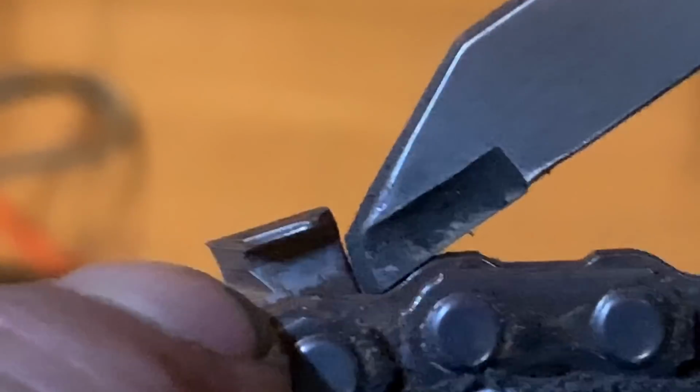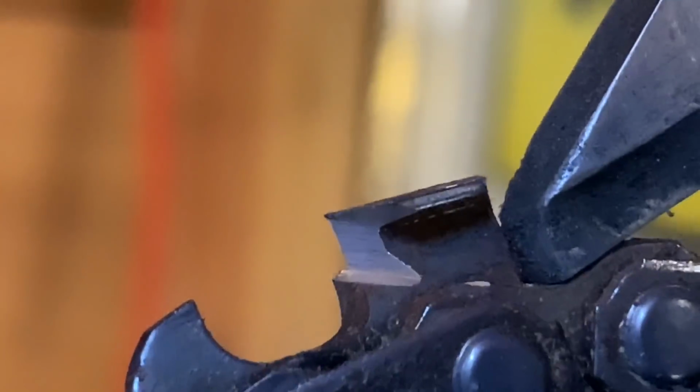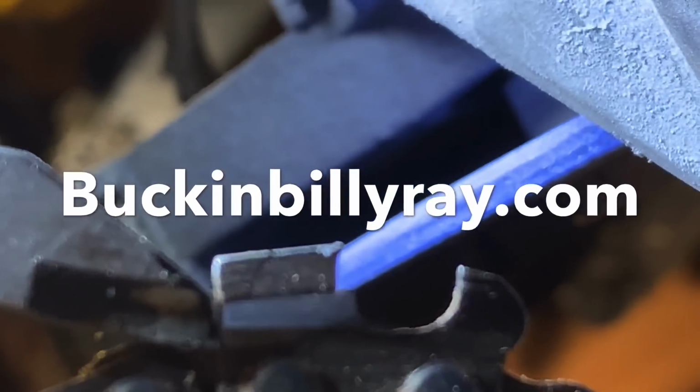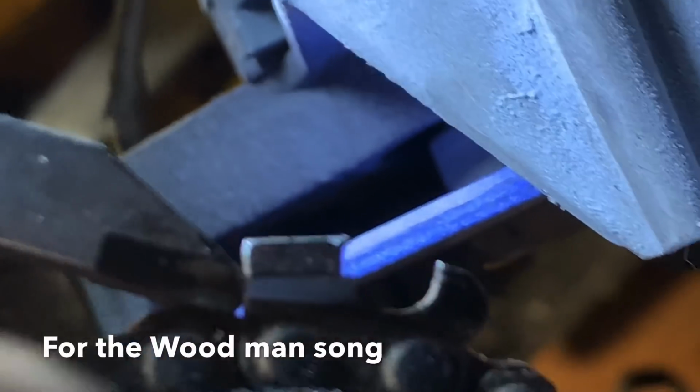Like under more. But look, sorry friends, just bear with me. I'm surprisingly getting a good shot of this. You see what I mean? Like this. This is a nice grind. It's durable, and it cuts. Now the side tooth is bare, almost straight up and down. Not quite. I like mine 5 degrees back, on the bottom back.